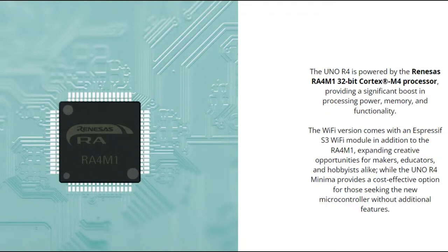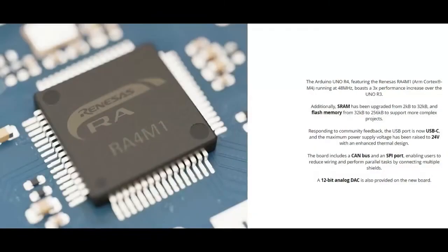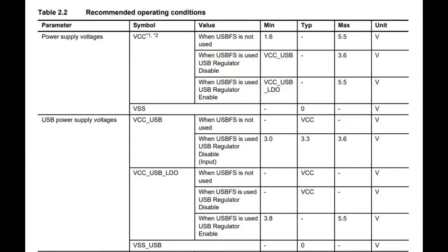It's got a lot of good peripherals. One of the big things is it is 5-volt compliant, as well as has native USB. It's a really nice step up from the previous microcontroller, and you're looking at a lot of peripherals and capabilities that you would expect from both the best of the 8-bit world and the best of the Cortex world.